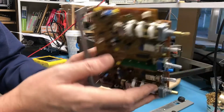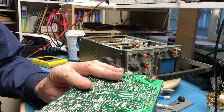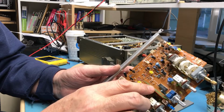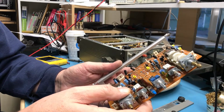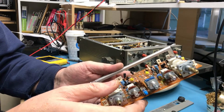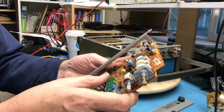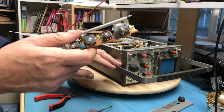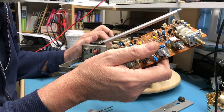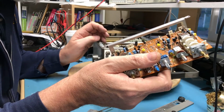It almost just might be some shielding. It's attached to what looks to be a ground trace in 3 places. That may just be an attempt at some shielding between channels, honestly. Board's a little warped, but that's typical of these phenolic boards. Again, looking at this guy, I don't see any physical signs of damage.